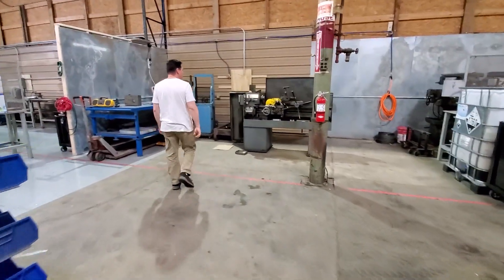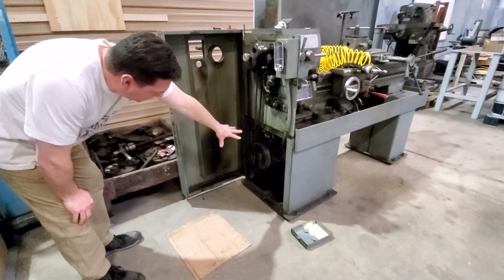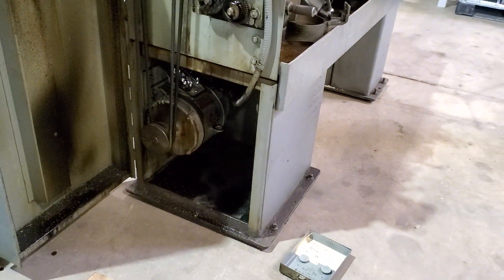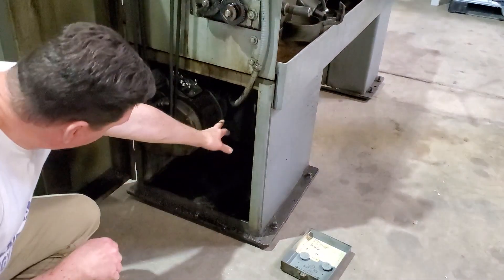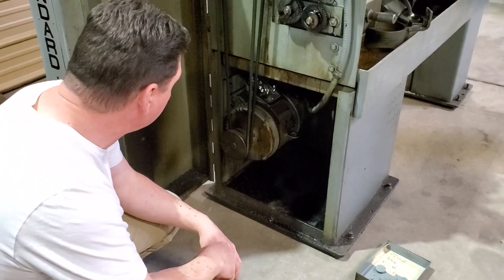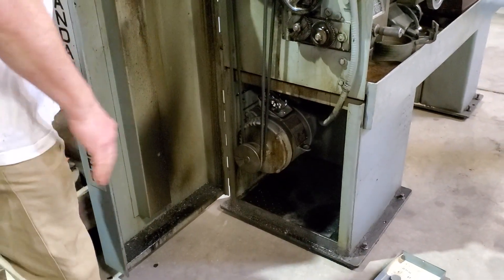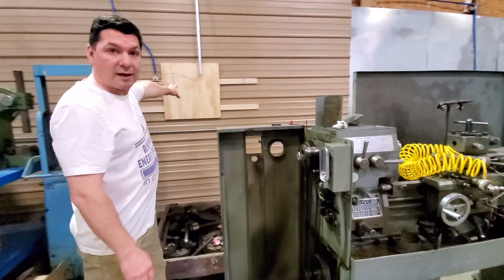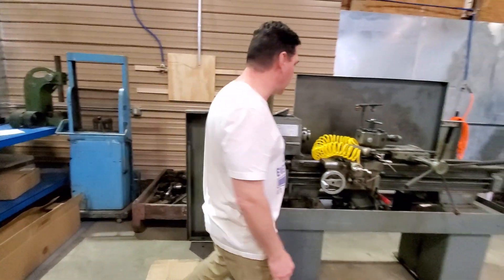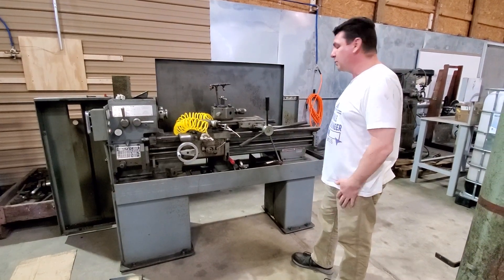The lathe — we're just doing the wiring. It's a little bit of a mess in here. I'm rewiring all the three-phase for the motor to be on 480V, and that's probably going to be Monday. I have to find a wiring diagram — there's a three-phase brake in the back. It's a high-power brake for the three-phase motor to stop it quickly when you take the power off. Once we get that finished we can wire this up to 480V with a disconnect switch. We have this big beautiful lathe — it's a tank. I'm excited to see how this runs; we haven't even fired it up yet.